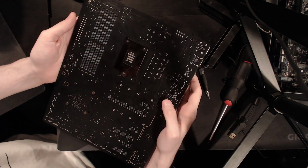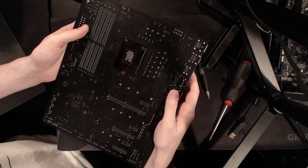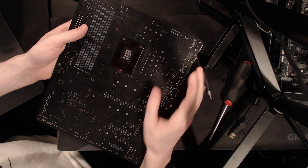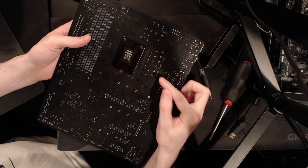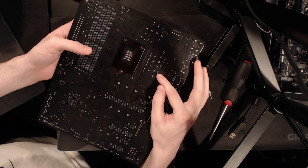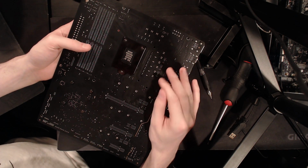the back of this board. Well, it's not that special, it's a type of doubler, but it's a much smarter doubler than what you normally get. These right here are Intersil ISL6617s. And the really, really cool thing about these guys is that they do current balancing.